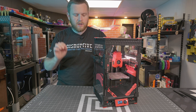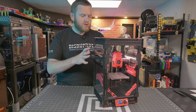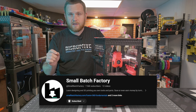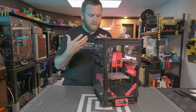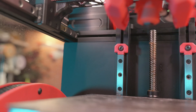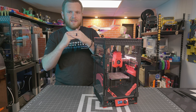I do want to go over some cons and issues I had with the kit. When I first built this machine it took me a really long time to find the issue with first layer inconsistencies — I'd already printed spools and spools and just kind of dealt with it. What was actually happening, I only found thanks to Brian from Ballistic Tech who sent me a link to a YouTube channel called Small Batch Factory. He explained that this printer levels at the bottom then goes all the way up 120 millimeters, and it eventually bottoms out on the two end stops on the linear rails — either because they're positioned differently in the kit versus official Voron builds, or the linear rails themselves are just a hair too short.